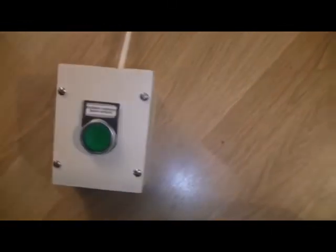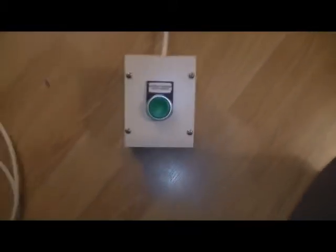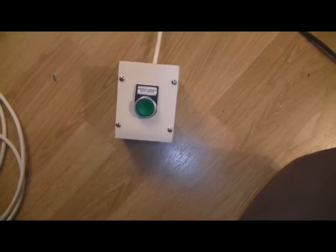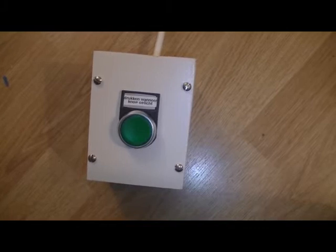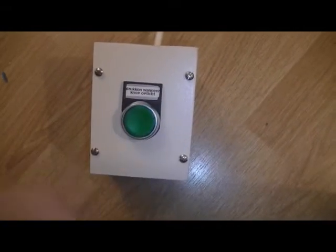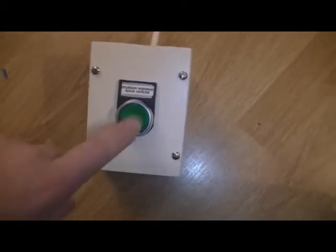This is the second control panel, which says 'press when the button is lit.' There's a light inside but it's not hooked up right now. The button is hooked up to the power supply unit — the PSU — which is a 300W old computer power supply. When you connect the green wire and the black wire it turns on the power supply. In the end it's going to work with a key switch on the large control panel, but just to test I hooked it up to this button.